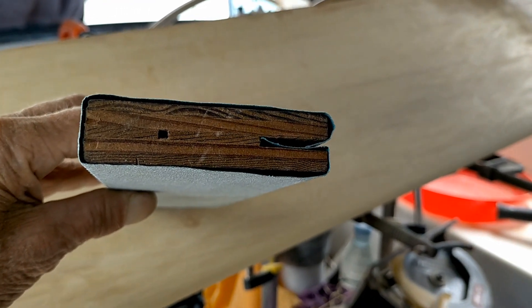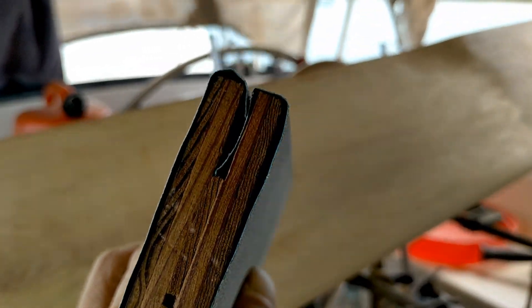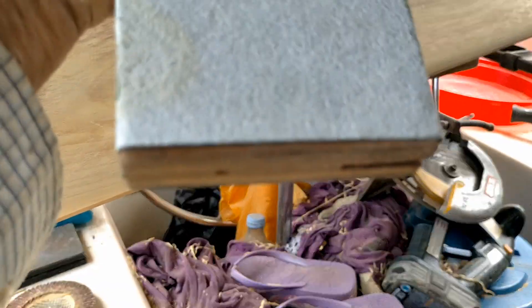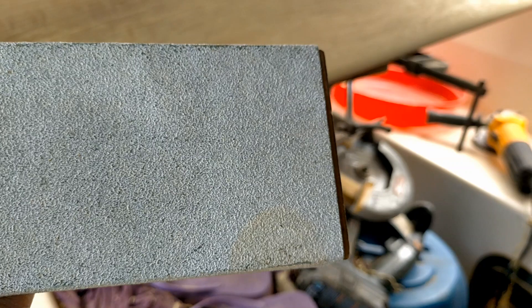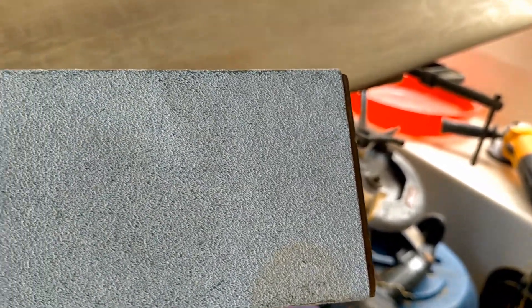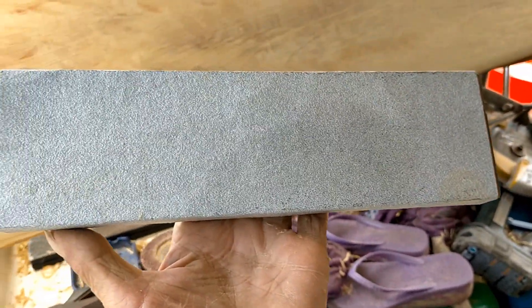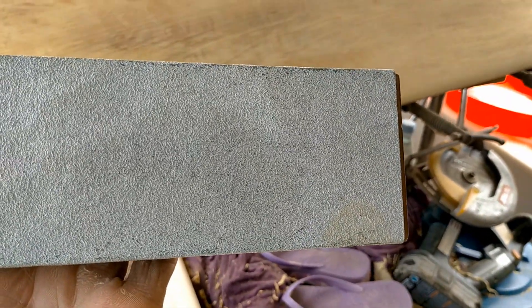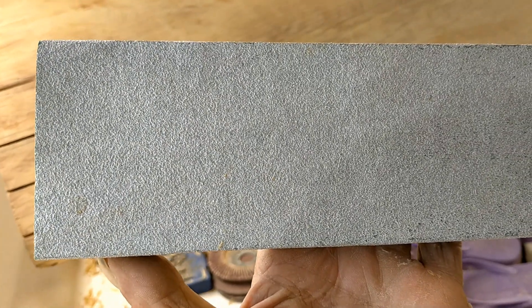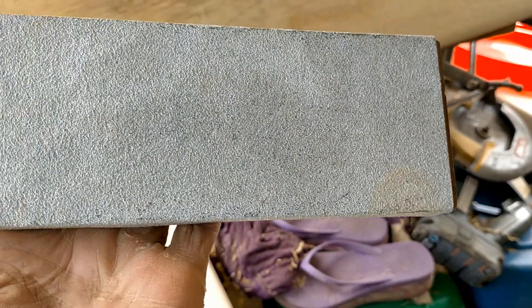The groove is a little too deep but it still works. You just fold over each edge of the sandpaper, make a little sandpaper box, push the plywood into it, and it gives you a nice flat sanding board — at only the cost of a sheet of sandpaper and a scrap block of wood; solid wood works as well as long as it's flat. Some guys put a 3-inch by 18-inch or 3-inch by 21-inch sanding belt on there instead, but it's very expensive compared to a single sheet of sandpaper. This is 80-grit aluminum oxide paper, which is good because it doesn't clog up and has enough tooth to do what I need.